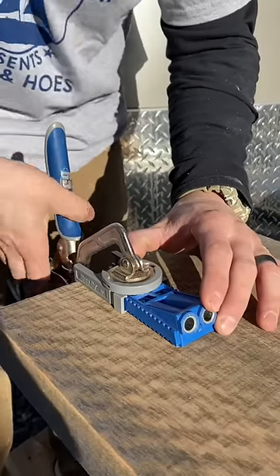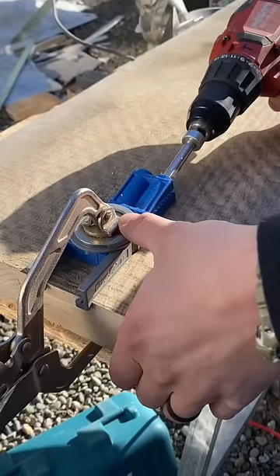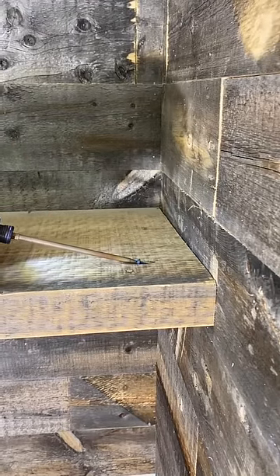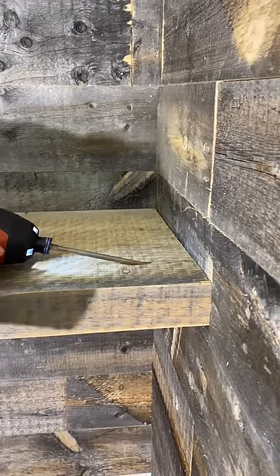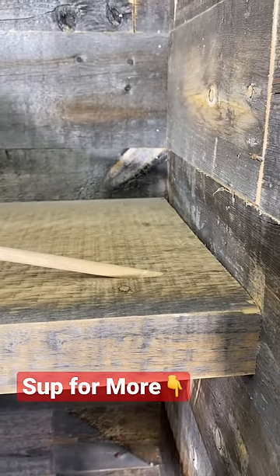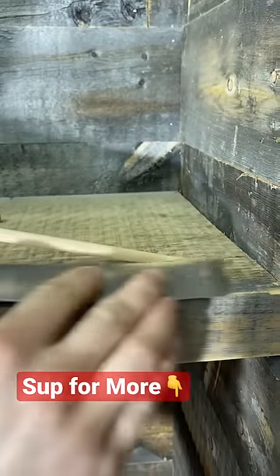The key trick is to make sure you're hitting some type of stud on that side. Put a pocket hole there, then screw in and hit the stud — and it'll tighten up just like that. To hide it all, just glue in a little stick and then cut it off to make it perfect.